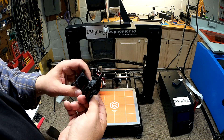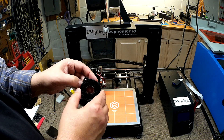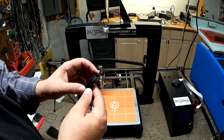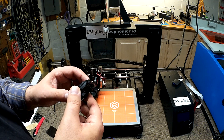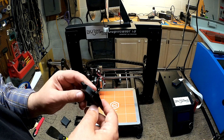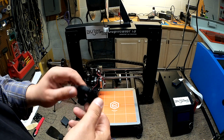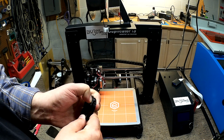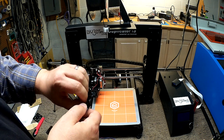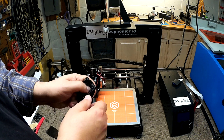Anyway, one of the things I did is I remixed this and I was having a hard time coming up with a mesh to fit on here, so I created my own in Tinkercad. You can kind of see a little bit of the artifacting — I may actually knock some of these edges down before I put this up on Thingiverse. I wanted to see how it printed first. Because of this overlap, I did print with supports, and these are a little bit firm.